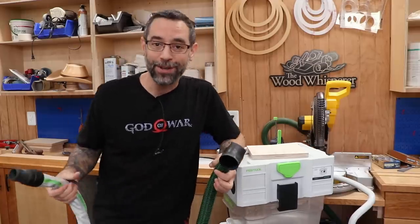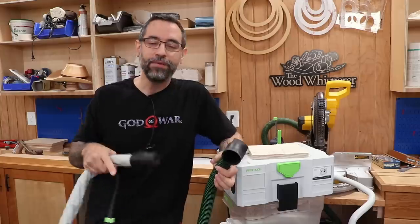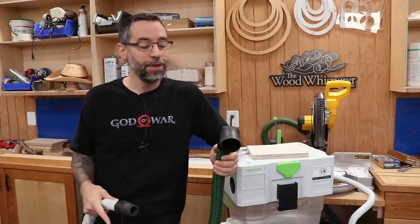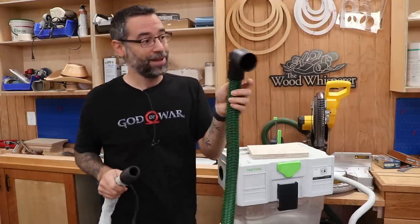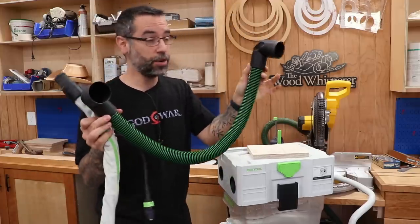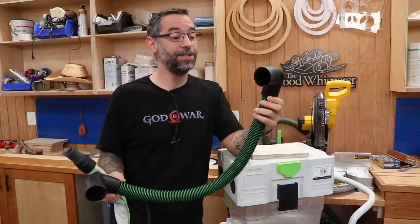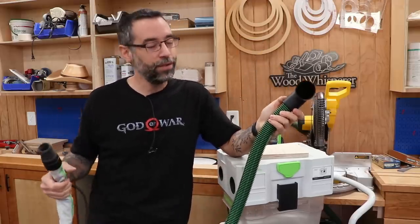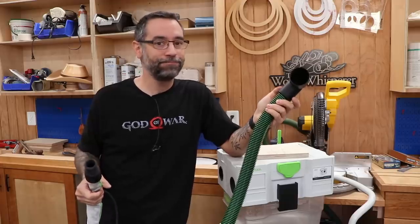Now, if you've studied up on dust collection, you probably already know that whenever you take a hard 90 degree turn, airflow can suffer, right? So I think a lot of people were watching this saying, this 90 degree, especially 90 degree on both ends, the one that comes with the CT Cyclone, is probably killing some of the airflow. So when I swapped that out, I really expected to see a pretty big improvement, and we didn't, right?